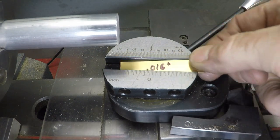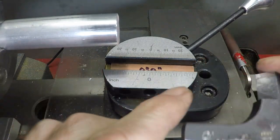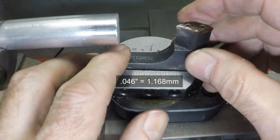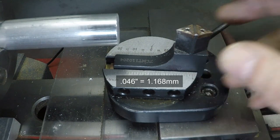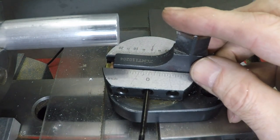Notice that I'm now putting a couple of shims in there. A total of 0.030 plus 0.016 is what worked on my machine. I think they deliberately left a little space under there so you could center it for your specific machine.